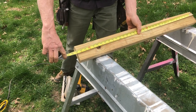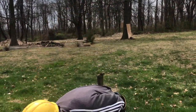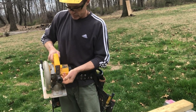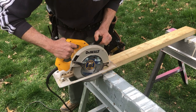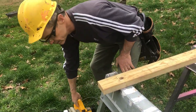When you're done, there should be just barely some of the black line visible, and the length should be exactly 35 inches. Today we demonstrated how to cross cut a 2x4 with a portable circular saw. One thing I forgot to mention: make sure the depth of the saw is set properly — just slightly below the depth of our stock using the depth gauge. I had already done that before the cut in the video. Thank you for watching, have a great afternoon.